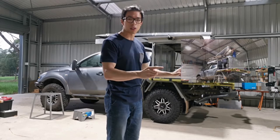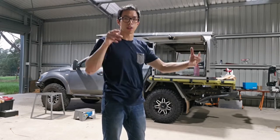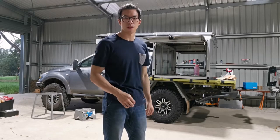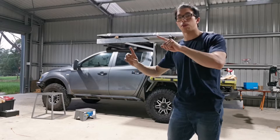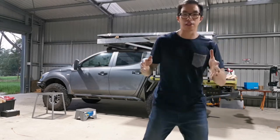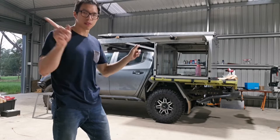In our case we have to lift the whole thing up — both front and rear. You have to have balanced forces. Any net force, and obviously that's where things will go. If there is a gas strut pushing in one direction, there must be another gas strut of identical strength pushing in the opposite direction, at the correct angle as well. Our plan is to have two in the front, two in the rear, pushing on an angle — same direction on both sides.